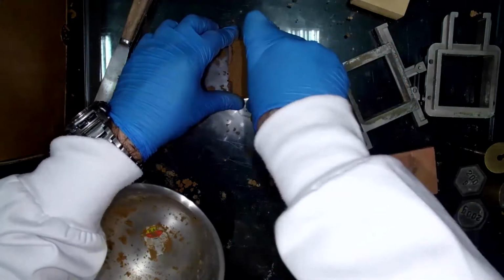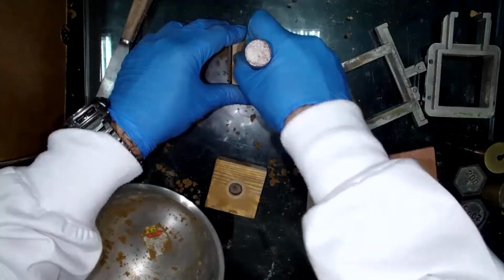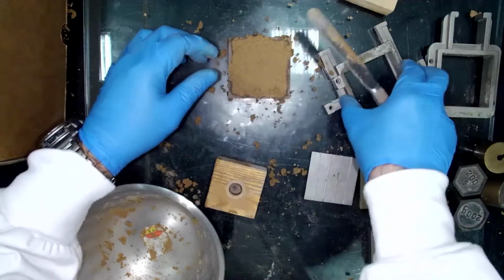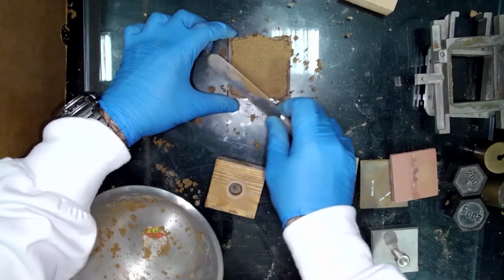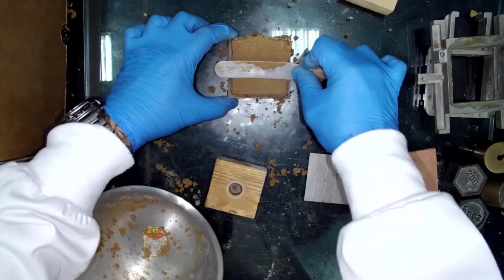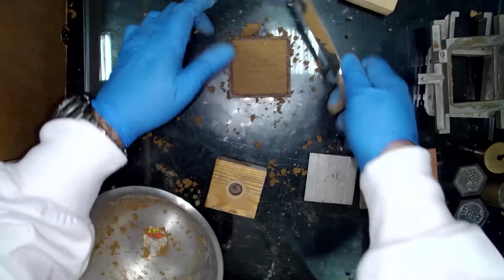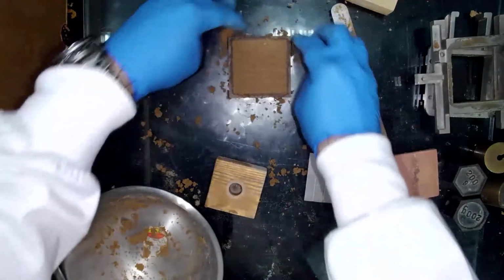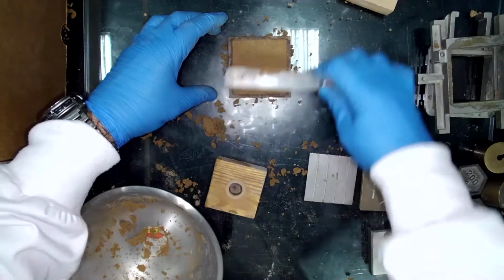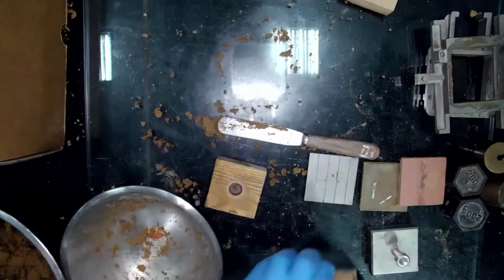After we reconstitute the sample, we trim the surface and make sure it's flat. The preparing of the sample should match the density of the sample in the site from where it was taken. Slowly, we reconstitute the sample until we reach the desired result.